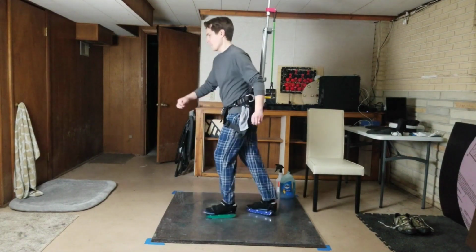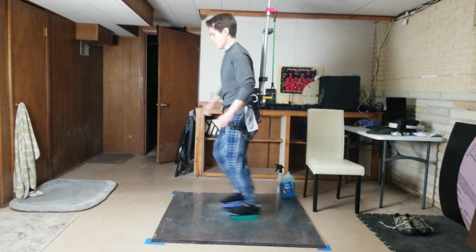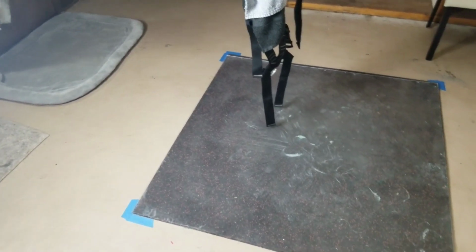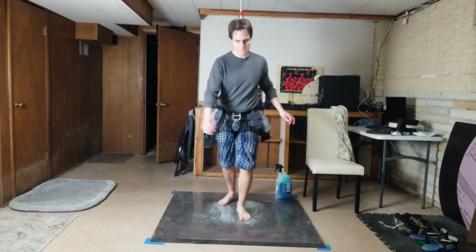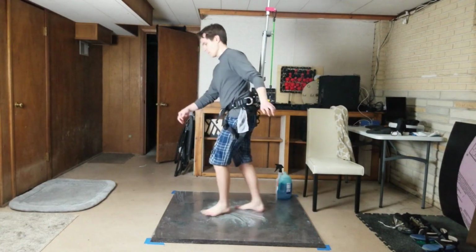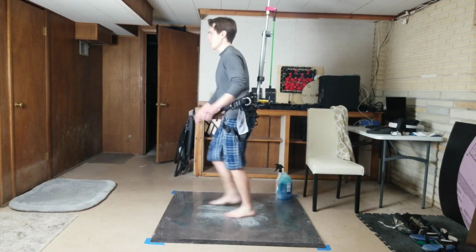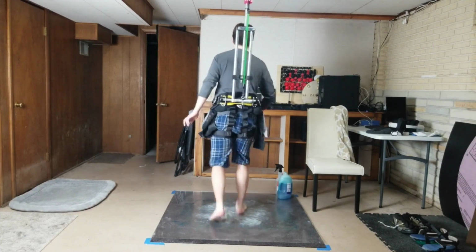It's still pretty slippery and I think it could use improvement, but I still liked barefoot or my old worn out shoes more than this. So what worked the best was acrylic as the floor material, lube or dish soap as the lubricant, and worn shoes, barefoot, or silicone pads as the shoe foot material. I should also note that a long time ago I tried carpet sliders on carpet and socks on various materials, but found that just had too much friction.